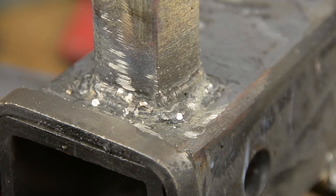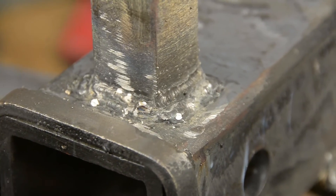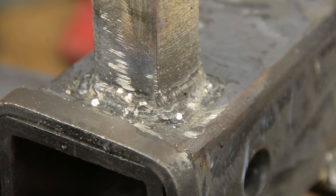You've heard the expression trying to make a silk purse out of a sow's ear — at the moment I think a sow's ear would be an upgrade from where I'm starting. The reality is that the 90-amp flux core welder is really struggling, even with the MAP gas preheat, to do anything effective with this much metal — that quarter-inch thick steel is just a real bear. Running multi-pass welding with flux core is a nightmare because you have to stop and clean it up between each pass. Nevertheless, I think this is pretty sturdy. If it breaks, I may have to get myself either an oxy-acetylene or a stick rig for more oomph, but for now that's what we have.